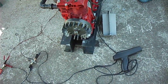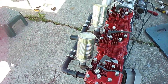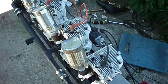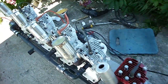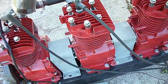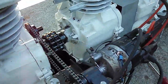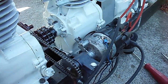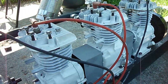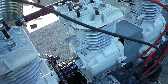Here I've done the spark timing test on it. I've got the intake manifolds all in place, my exhaust caps on to keep rain out of the exhaust if it leaks through the tarp. Got my coupling guards on — I'll put the one on the chain drive distributor there. The coil's mounted. So other than the carburetors, it's pretty much ready to roll at this point.